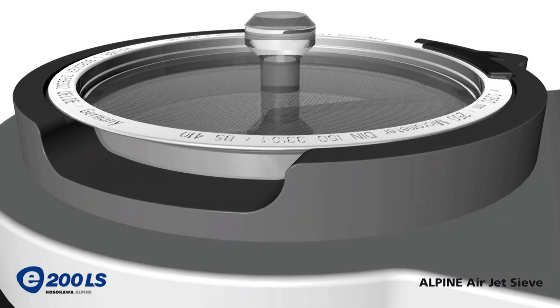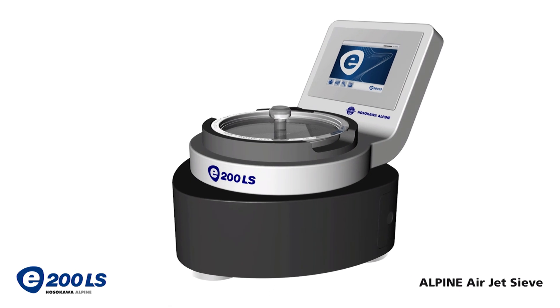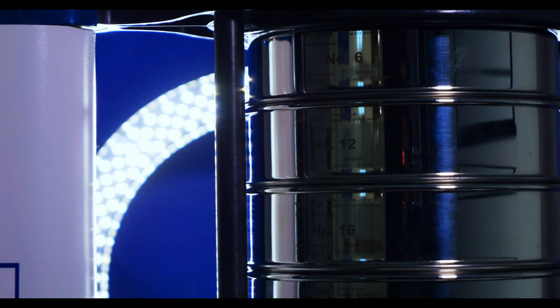The E200 LS can recognize each screen by its RFID chip, count down uses, and let you know when it's time to thoroughly clean it. The screens can go a bit longer between cleanings because the machine is powered by air, and there's also a sieve cleaning function that lets you place empty sieves over the air nozzle to dislodge blinded apertures — though this is meant for minor cleanings only. It's recommended to routinely clean the Airjet sieve after testing and schedule a yearly calibration, deep clean, and maintenance routine to verify vacuum pressure and diagnose any filters or lines that need replacement. As for the Rotap, it's a mechanical machine with many parts that suffer wear and tear over time. It's not uncommon to need to replace parts or oil the machine, and W.S. Tyler sells maintenance kits with the most common replacement parts so the problem can usually be solved in-house.